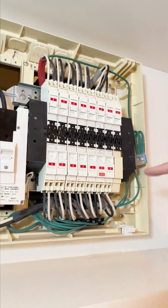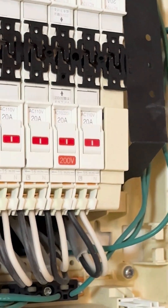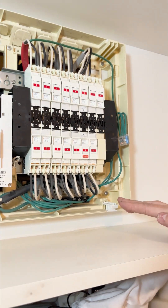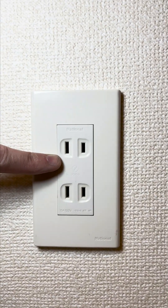The individual circuits are at 100 volts, except for one that gets 200 volts between red and black. Ground is also provided here in the box, but as is typical in most Japanese homes, individual outlets don't usually have a grounding pin.